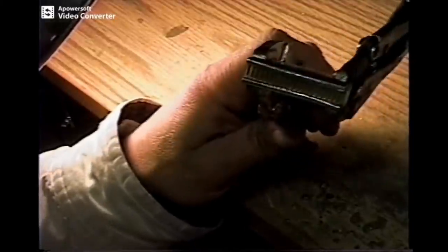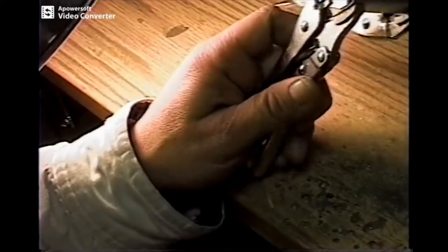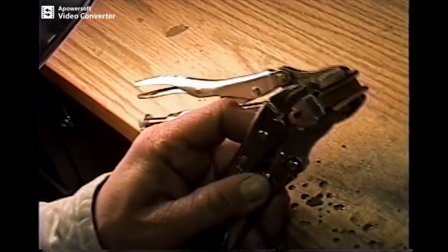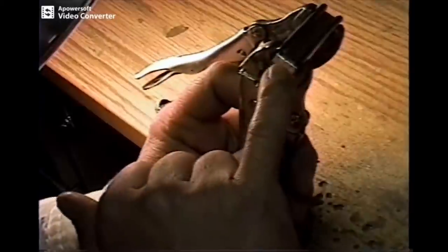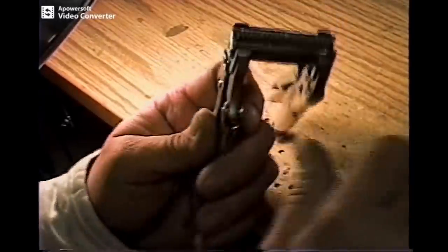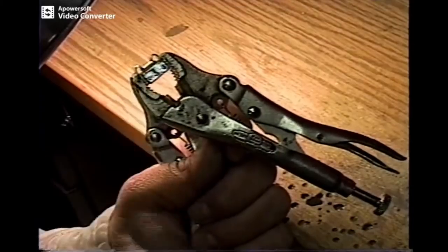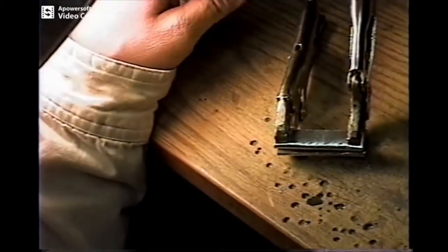There you go. I'm going to let this dry for about a minute or two, and I'll show you next where we have to apply the putty, which is basically where the holes are at, where we made the curves on the duct metal. See right through it. That's where we're going to put our putty. Alright, we're going to let this dry a little bit and go from there.